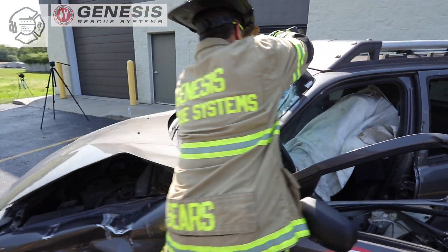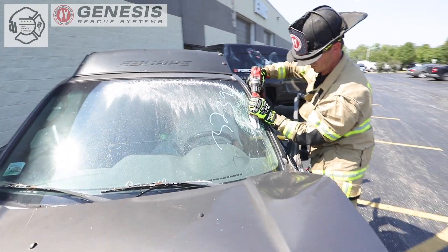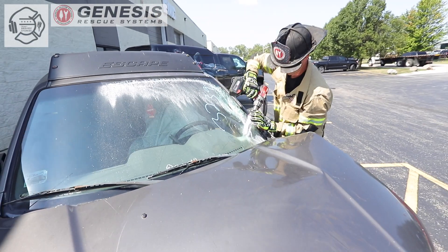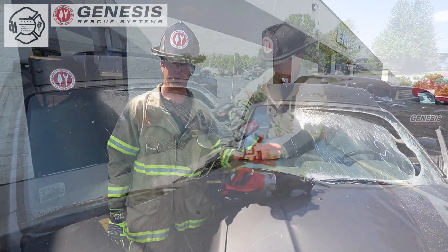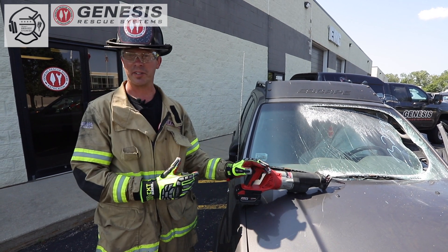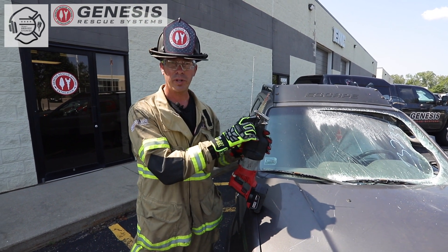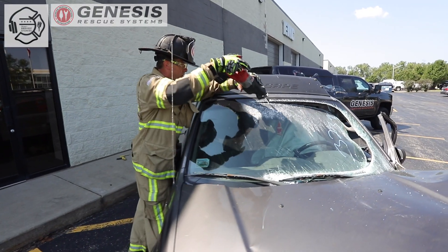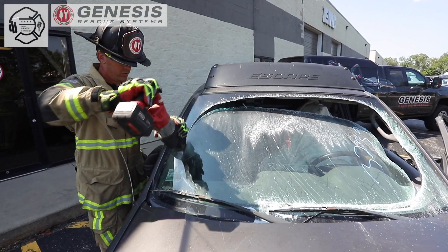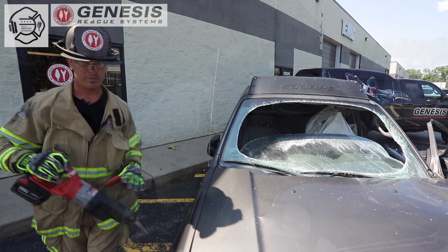The Beluga tool is a nice way of removing the windshield very fast, and it puts a safety ribbon in there so we don't have dust or glass particulates shooting vertically that could potentially harm the rescuers. Our other option for laminated glass removal comes from our friends in Oklahoma City who often advocate using a six-inch wood pruning blade on a sawzall. Although it is more rogue of an operation and has a tendency to throw shards of glass much higher, it is a very quick, effective way of getting through that laminated glass.